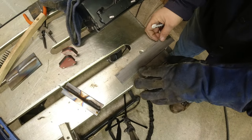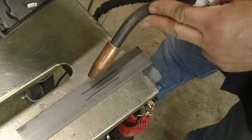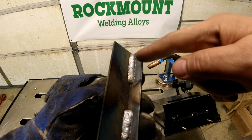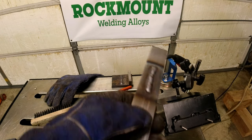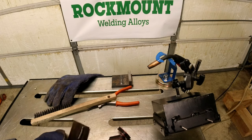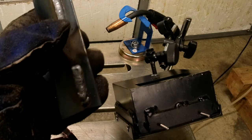Here's a fun little exercise you can do — just lay a couple of sharpie lines down, take your gun, and weld from here to here. Just weave it back and forth in those patterns we talked about. Your welds where the material has somewhere to go are going to look a lot different than your welds laid flat — they're going to be more humped up because there's nowhere for the material to go. Practice running the bead on the lap or the fillet.